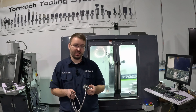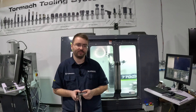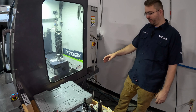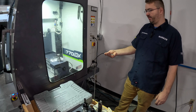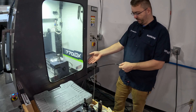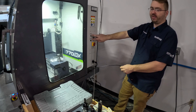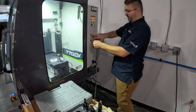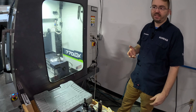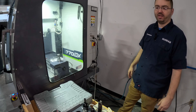We're going to go over the installation section first and then we'll dive into using the ETS to touch off your tools manually and automatically. For our first step we're going to connect the cable of the ETS to the accessory port on the side of the electrical cabinet of our machine. You can see I've got the end of our cable here that I've fished through a gap in the enclosure panels and we've got two accessory input ports here. We need to make sure that for the ETS we connect that to the second accessory input. If you're working on a 24R or an XS-TEC the accessory port location is different, so we'll make sure to have a couple photos showing those locations as well.